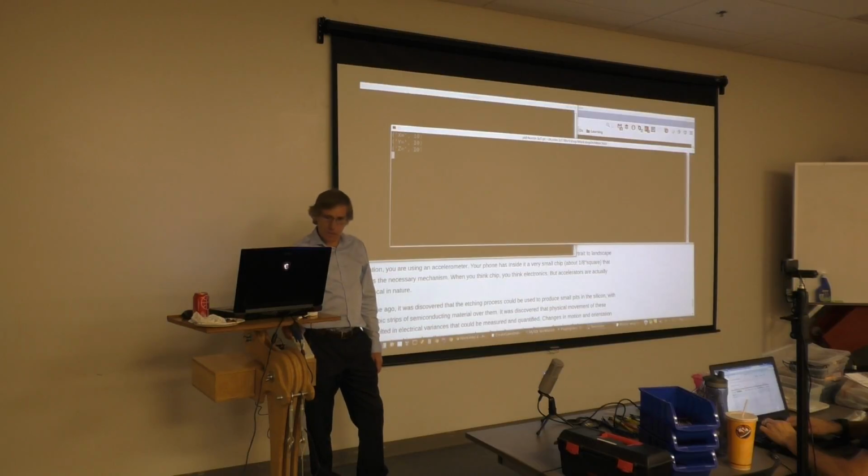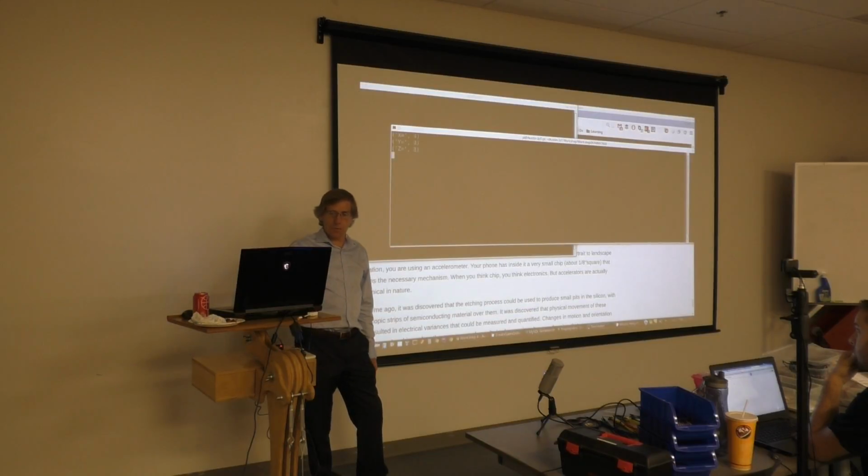This axis, I don't know if you can see my hand, but this is the axis that it seems to be measuring. Because when I lay it perfectly flat and I go in a different axis, the numbers don't change. So it almost seems to me like all three of these numbers are reflecting the one axis of rotation. And I've looked at the code and I can't see it.